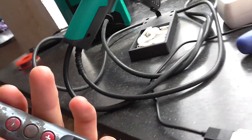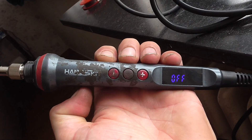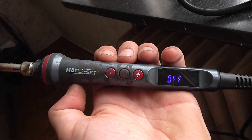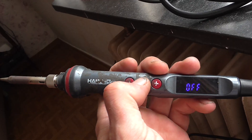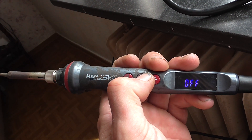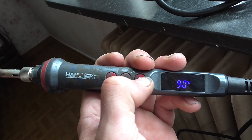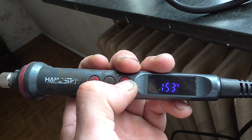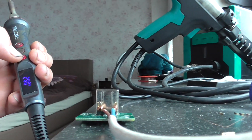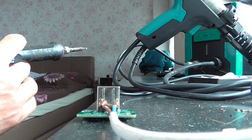Let me show you what I use here — it's a very neat soldering device you can get for around 25 bucks on AliExpress or Banggood. It warms up very fast and you can set the temperature here. First you have to turn it on by pressing this for several seconds. Now see how fast it goes — it goes up to 350 degrees, and I'll solder those cables onto the pins.